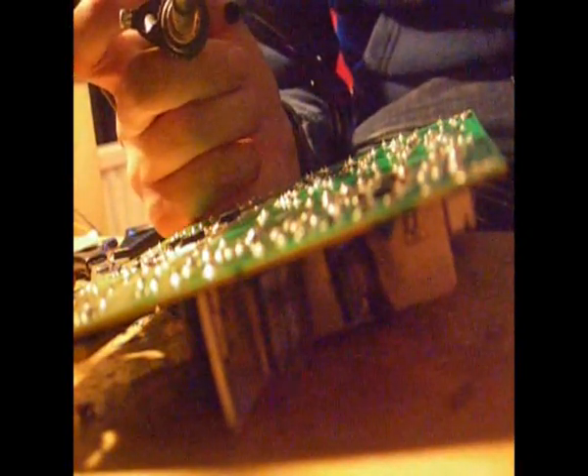It's not bulged and the ESR's good, but you don't know how long these will last — I've replaced a lot of JH and Capxon caps and they don't last. You can see through three of the holes when you hold the board up to the light, but ideally you need to see through all of them. I'll take some solder wick. I don't recommend the stuff from Deal Extreme because it's fake — it doesn't contain any flux and it's basically useless. I got this on eBay cheap — it's high quality, actually made in the USA. It's Chemwick, by Chemtronics.